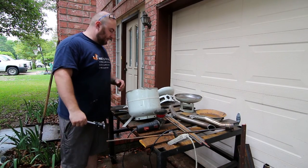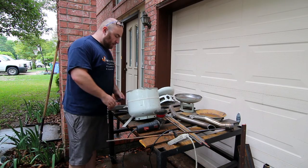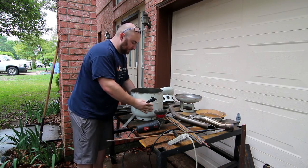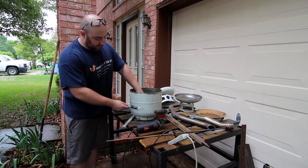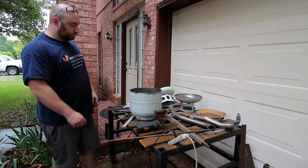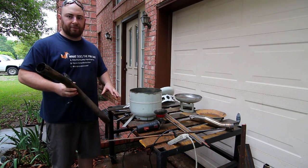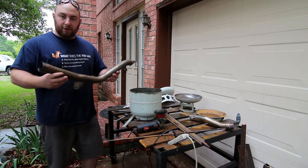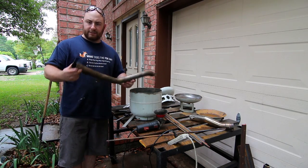I left last night and went to party and it rained, so I had to spend the first part of today cleaning everything back off again with the wire wheel. Now we have the base all welded up. I measured off three inches — it's actually five inches up off the ground to accommodate for about an inch of spacer down there — and this is going to be the bottom of our floor. You want your air coming in somewhere near the bottom of your coals; it doesn't have to be all the way on the floor, but near the bottom.